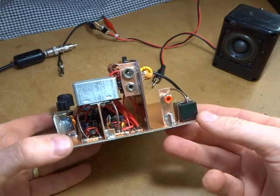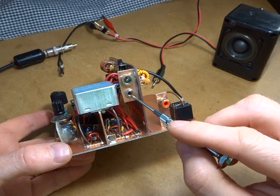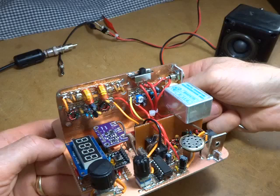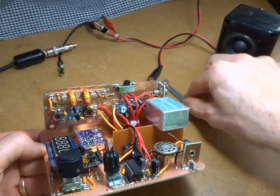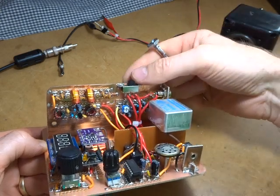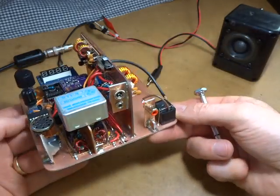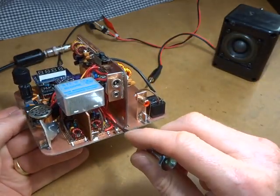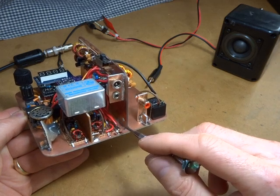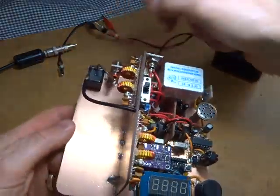Nothing too much to see on the back half there. DC up here for the 12 volts, the microphone input and the antenna. The TR switch is in place here — the center is hot on the 12 volts coming in, obviously receive on this one and then transmit down to here. There's a little circuit board there with three runs which is either hot, the transmit or the receive 12 volts. That's all working well now, so I'm happy with that.